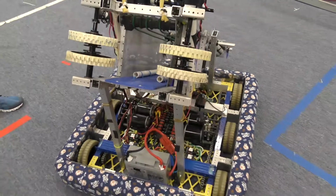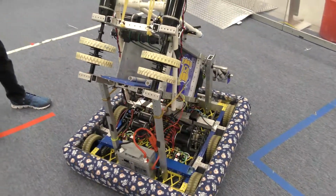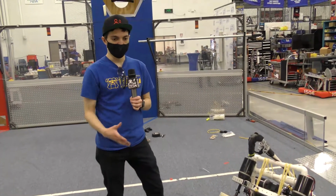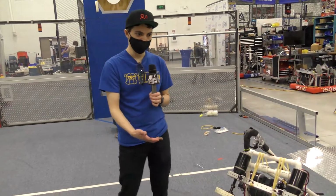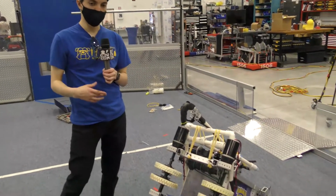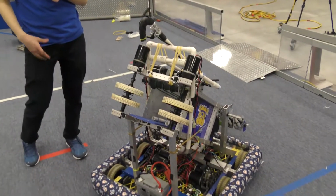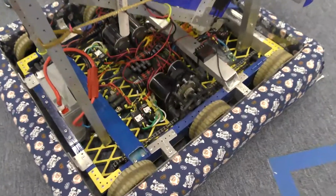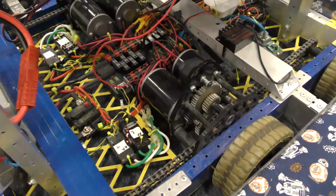Luckily, the game hasn't changed too much from last year, but with our robot, we just went for a simple auton that just shot 3 balls and drove backwards. We also had a 5-ball auton where it shot 3 at an angle and then drove into the trench. We would actually go back and add encoders onto our robot and a gyro so that we can properly get those balls every time from the trench, as we found it to be very inconsistent just trying to use power turning.